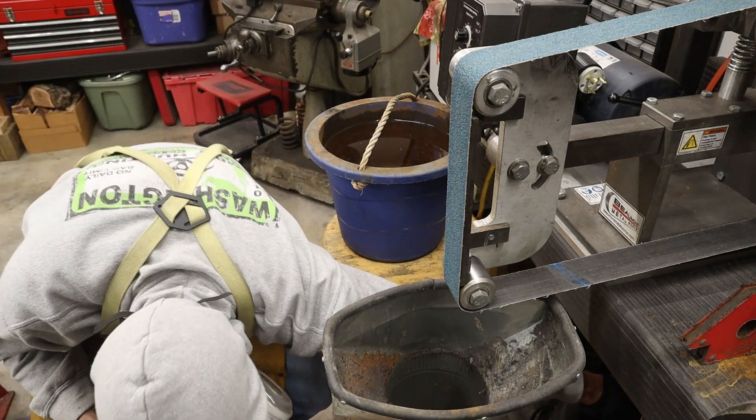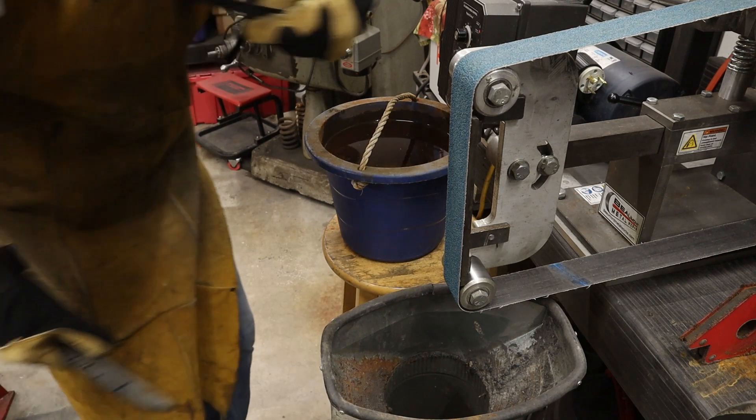That just highlights your scribed line. I'm not going to shape the tang yet — that gives me something to hold on to. I'll go ahead and shape the tang after I get the bevels ground in. This is a large Puukko knife — most Puukko knives are smaller than this, but I like big knives. So we're still working pre-heat-treat here, and I'm going to do the first grind, which is a steep grind right into these grind-to lines to get my edge thickness dialed in. I'm using this worn belt because cutting into the fresh edge will shed a lot of abrasive — no reason to ruin a brand new belt.